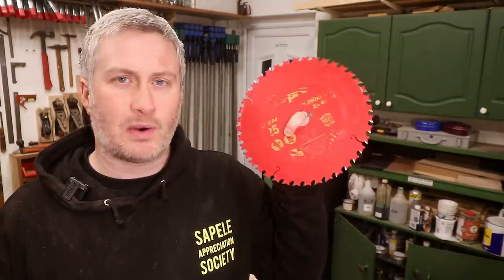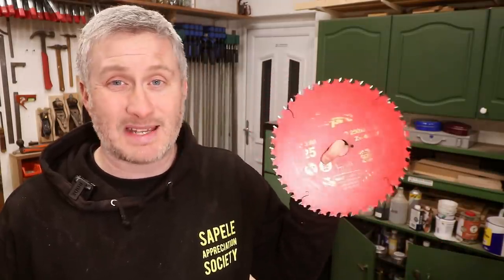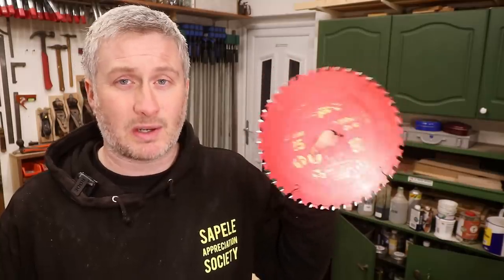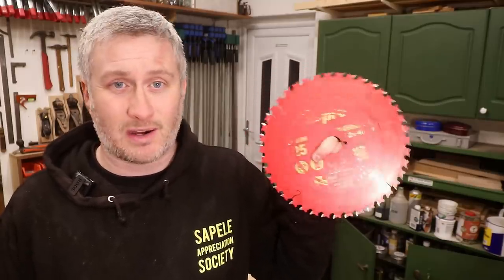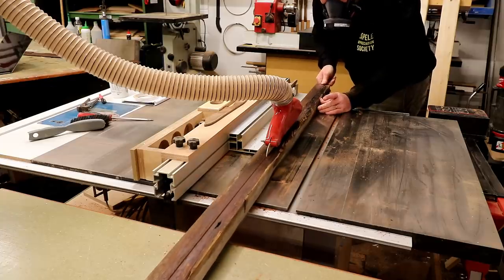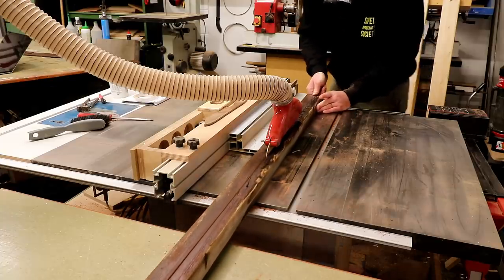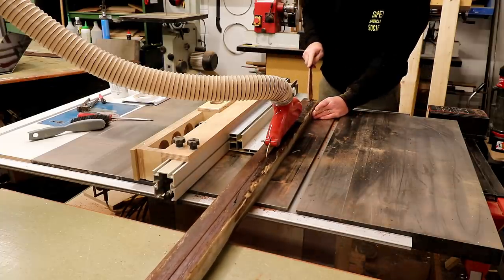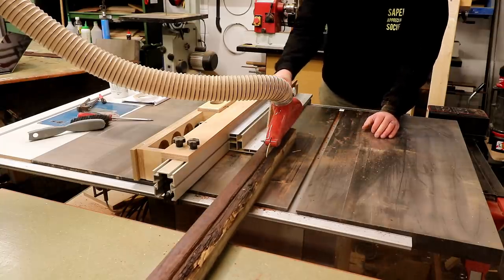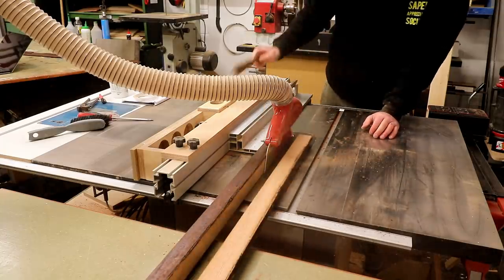Blades are one of those things, in my opinion, where it's worth spending the extra money to get something that's good quality. I generally look for Freud, and I have no affiliation with them, they're not a sponsor or anything, but they make professional level, good quality blades that last a very long time. I work a lot with reclaimed timber, so occasionally I'll cut through a nail or a screw, and the carbide teeth on these blades generally cope with that really well, unless of course your feed rate is too high and you're really ramming the material along with bits of metal through the blade.